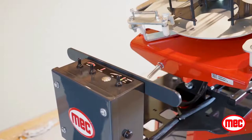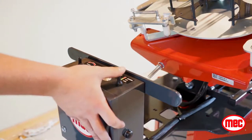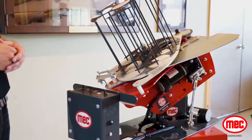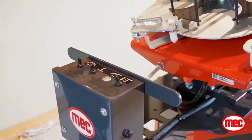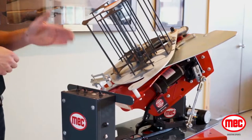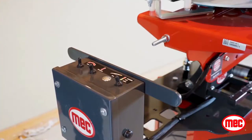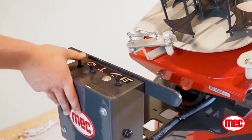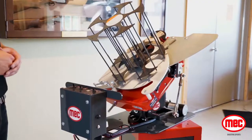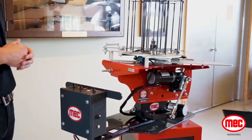We'll get started by looking at the electrical box. To operate this machine, simply flip the arm/disarm toggle to the rear position — this will drop your clay. To turn the up and down elevation on, simply flip the elevation toggle back. Now the automatic up and down elevation will begin. Lastly, to turn the rotation on, flip this toggle in the backwards position. Now you have full automatic oscillation, both side to side and up and down.